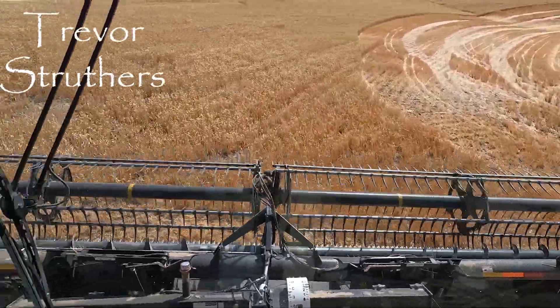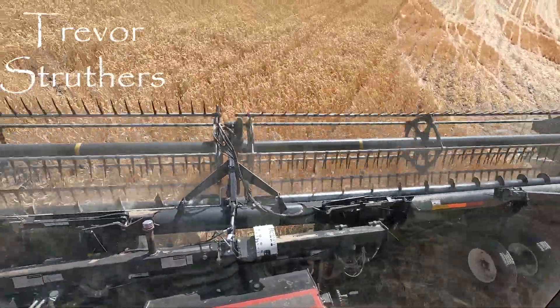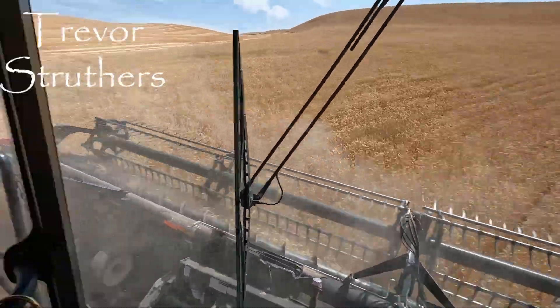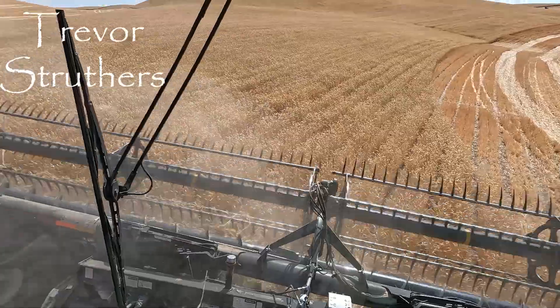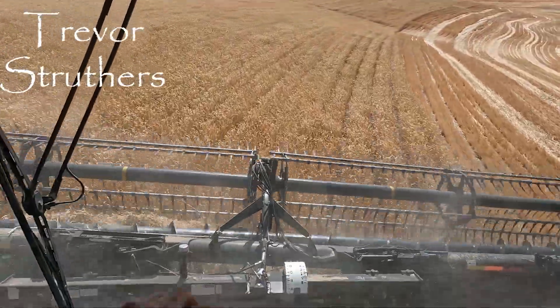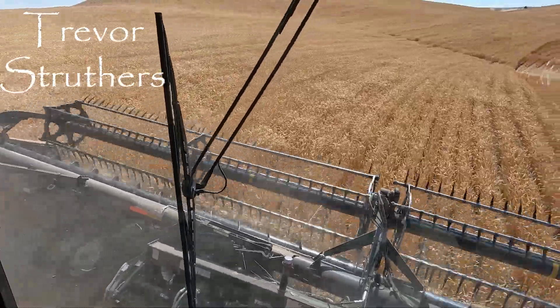Put the header on the ground because this wheat is short. Four is the highest you can press down on the ground, so I'm looking for a three or a two. Once I get it to three or two, I level it back and forth to try to find level — so that way it's equal everywhere. That looks too fast; slow down the reel just a little bit.